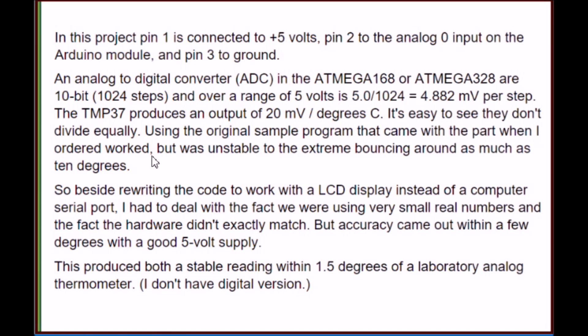What you're going to see in the video is a little different than before. I've connected this to an I2C display, which is much simpler than the original multi-pin connections I've had before. I did a comparative reading and it came within 1.5 degrees of a laboratory analog thermometer. I plan to be using this to hatch chicken eggs, and a degree or two is not going to hurt, considering the sensor is about a buck or two.